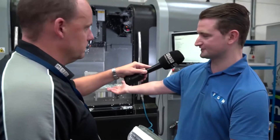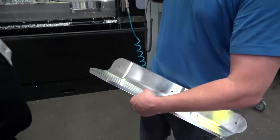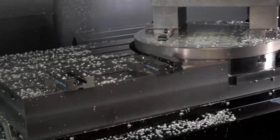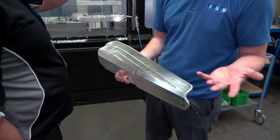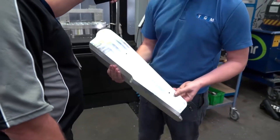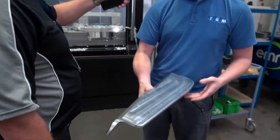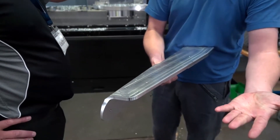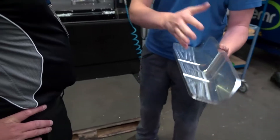It's capable of — on one side we can do the first op, and then use the 5-axis envelope so that we can machine Op 2 and Op 3. This part can be done as a billet prep, so it's simple — just blocking up, putting a couple of threaded holes in for the fixtures. We make two at a time: one of one hand, one of the other. We do all this side first, and then the mirror of it, and then once that's done it goes on a fixture, and we do all this inside, and it's all done.